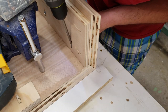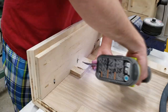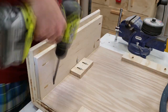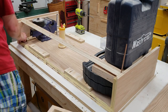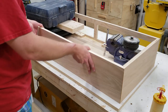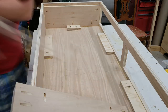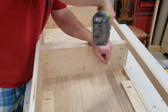To install the sides, I drive in one pocket hole, line up the other side, drive in the second pocket hole, then add a third cleat with a little space in between — since the piece was bowed, the pocket holes suck it in before the middle pocket screw is driven down into the tabletop. Glue is added and everything is screwed down. When installing the front where the drawers are, I used a spacer to push out the sides since they sucked in because my 45s weren't exactly 45 degrees. The same process attaches the back, then I marked the center rib location, applied glue, and checked everything with a square.